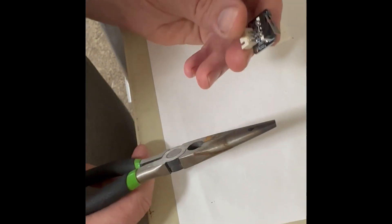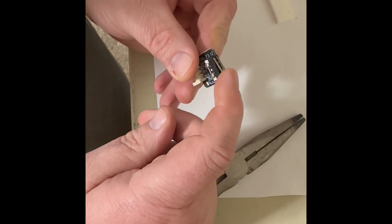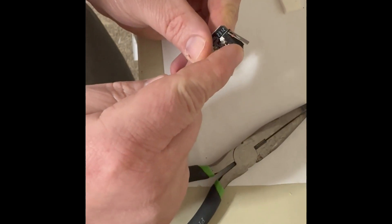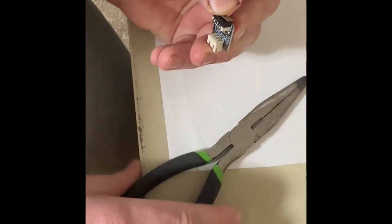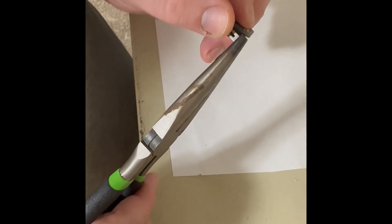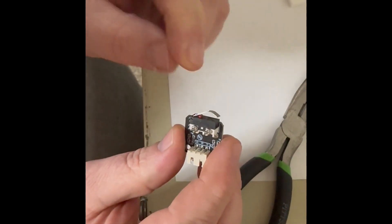There are three pins in here. I believe we're going to use the left-hand side, but it'll be inverted so it'll effectively be the right-hand side. You'll just plug your filament sensor wire — which is two prongs — into one side, and if it throws the alarm, switch it to the other side and you should be good to go. First thing we need to do is actually bend this tip over so that it's rounded off, so that when you change the filament it doesn't catch and snag on the sharp corner. I'm grabbing it with needle nose pliers and holding my thumb there so I don't break it off inside the sensor. There you can see how I've rounded it over.